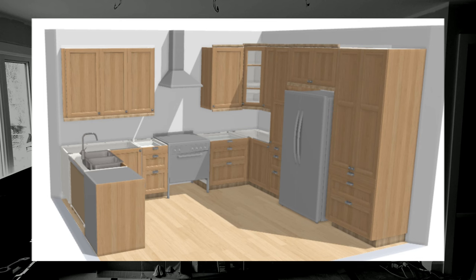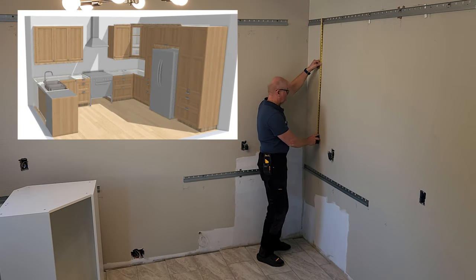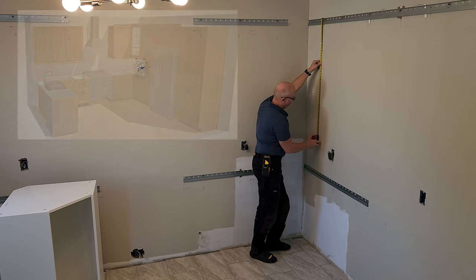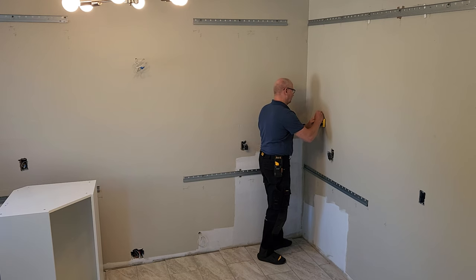With the power supply sitting under the cabinets, we clearly need to run the low voltage wires from the lights down to the base cabinets, and I run them in the wall. In case you don't have a stud wall with a void space, it's a bit more difficult — you'd need to somehow dig the tiny cable into the wall. But since there is a stud wall with a void space in 99% of all the houses where I install kitchens, I can run that wire inside the wall. In this kitchen we have a corner cabinet with cabinets on both sides, so we need two wires. I mark on the wall where the uppers start — basically 40 inches from the top of the rail — and then I use my stud finder to find the stud.